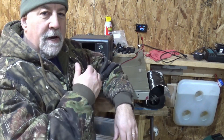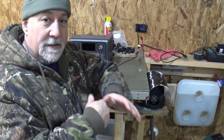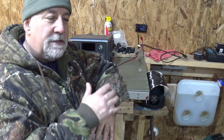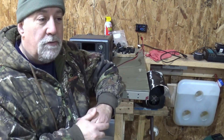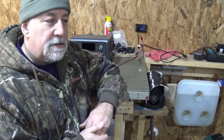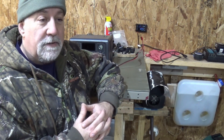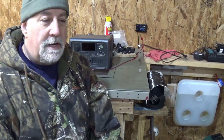In a future video, I'm going to cover running the diesel heater on the EV3A to see how long it lasts. I've already determined it works on the DC side — there's an earlier video I did on that, and I'll put a link in the description. It starts up and works fantastic. If you're running the diesel heater at four hertz, I think it'll run about 10 hours, maybe a little more. When I lowered it down to two hertz, it increased the runtime prediction on the EV3A to something like 22 hours — so that's awesome. If you're running it at a low level, it should run for a really long time, which is great news for people using these little power banks in emergencies or for camping.